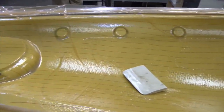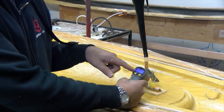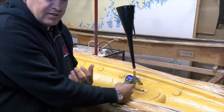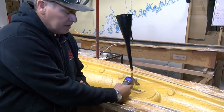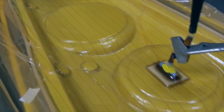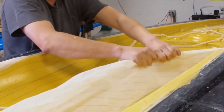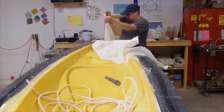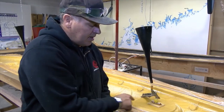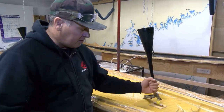The resin was introduced to the part about 45 minutes ago and the temperature is starting to go up — 118, 121, 124, 125. What's happening is the catalyst is starting to kick and the resin is starting to cure. As the resin cures in the part, this will set overnight. Tomorrow morning we'll come in and pull the bag and clear the mold of what we call consumables: the vacuum bag, the spiral wrap, the vacuum tape, and the ports where the resin was introduced.